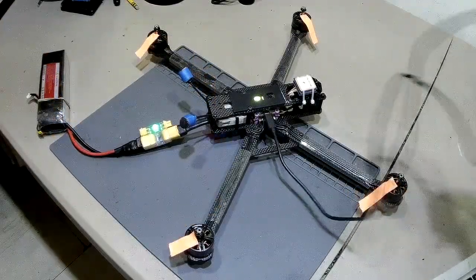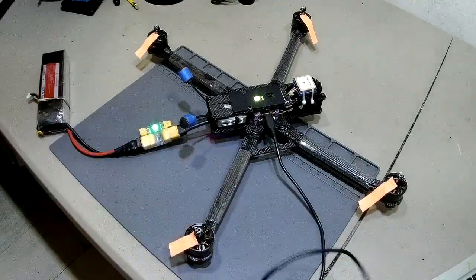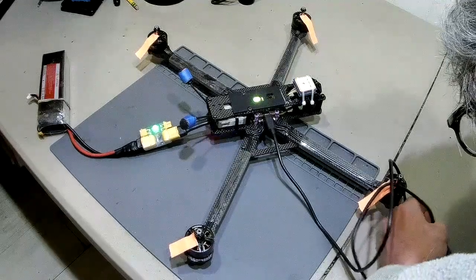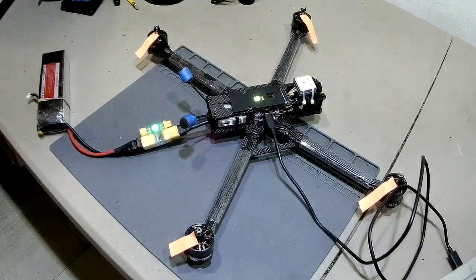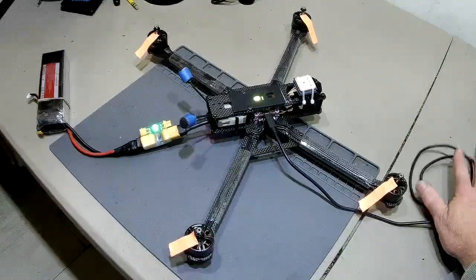In order to attach the computer to a powered-up quad on iNav, you have to power up the quad in advance or you will get a conflict. I got plenty of headache from not knowing that problem.